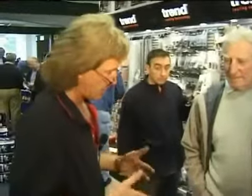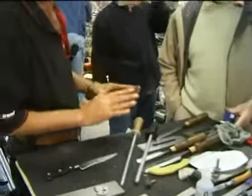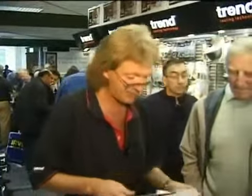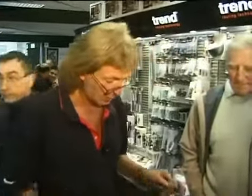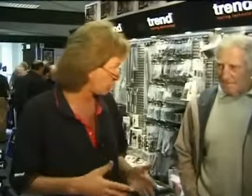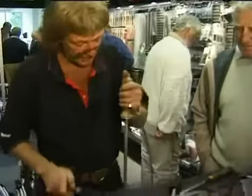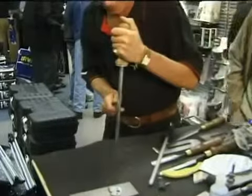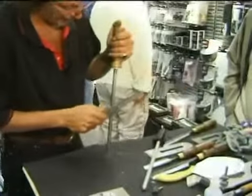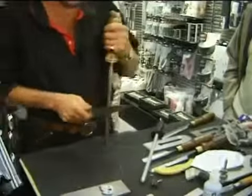The good thing about the diamond steels is that they actually remove material from the knife, only a little bit, but maintain it sharp. So if we're working on a blunt knife, it won't do anything. So what I would suggest that people do from the start is re-shoulder all your knives first. Probably the best way is to plonk it down like this, and you're coming in from here on a fairly shallow angle. So we're coming in on that sort of angle. We don't want to be out here because that's putting on a boning edge. You want it as fine as possible.